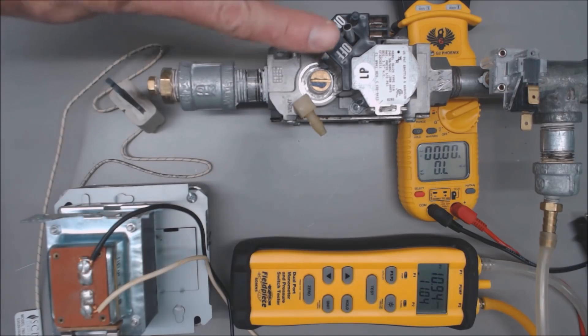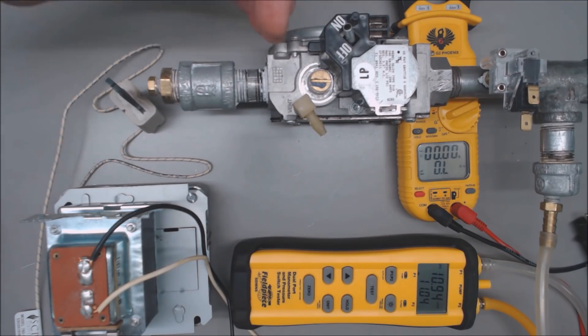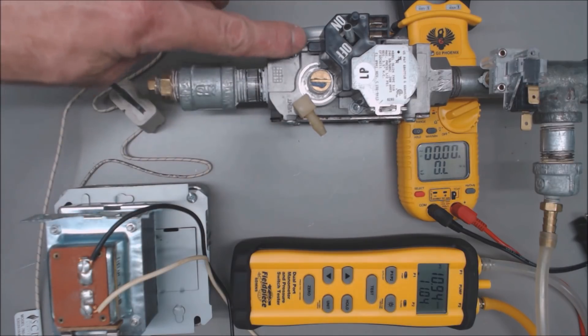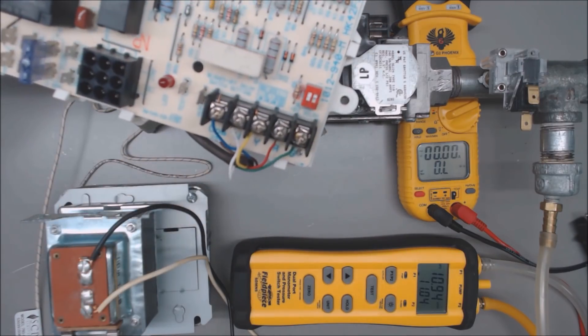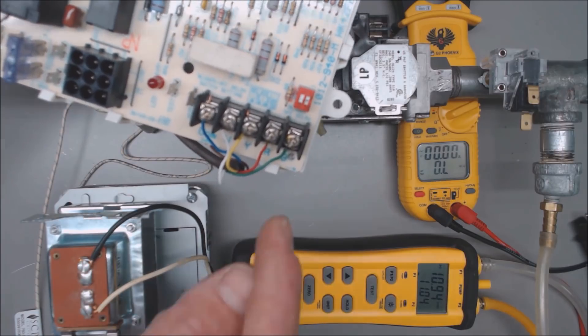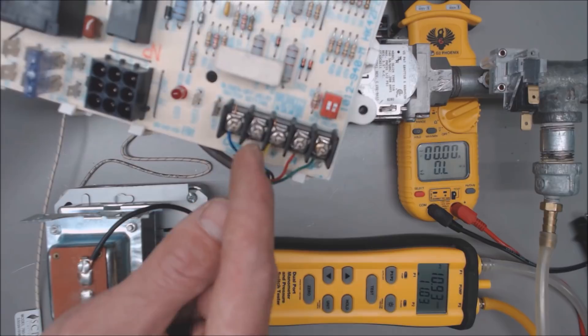A natural gas or propane direct ignition gas valve. This is a 24-volt electrical gas valve that sends the full flow of gas through and directly ignites the full gas flow. In order for this to turn on, you have to go through the sequence of operations. First, you have to have a call for heat at the thermostat, which means that R and W are touching. Then over here at the control board, the control board sees 24 volts on W, and you can read it with your multimeter from W to common.